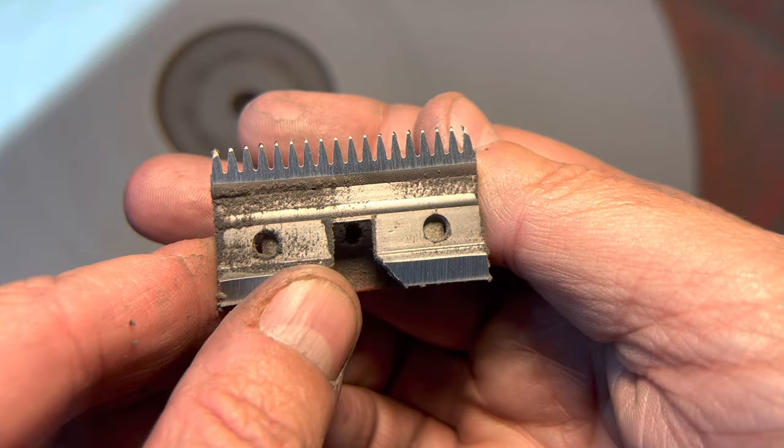I'm going to go ahead and demagnetize my blades. Now that my blades have been demagnetized, I always like to take the parts that I'm going to be mating together with the blade and do a little adjustment. These tools are made by Hamagari USA, which is another sponsor of our channel. I'm just adding a little bit of tension to the springs. I always add just a smidge of tension because we've taken a little bit off of the blade. I want to add some tension now because it's much easier to take tension off of a blade than add tension after the fact.